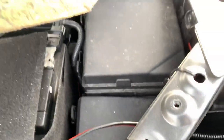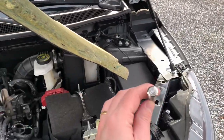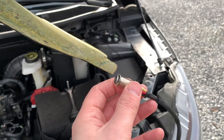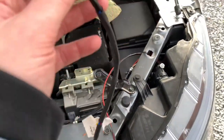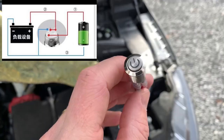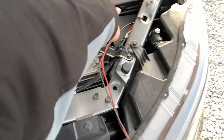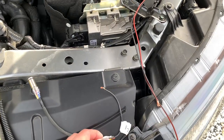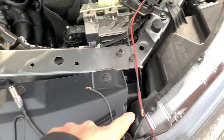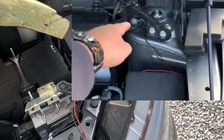Now it's time to make the connection. As I said, I don't use the switch in the old position anymore. I found this really nice little switch — there's a link in the description — and it fits right in this place. There are four pins: two for the light of the switch itself, and two for the in and out. The power source goes into the yellow cable power in, the blue cable power out goes to the red cable to the LED light, and the ground comes back and gets fixed over there.